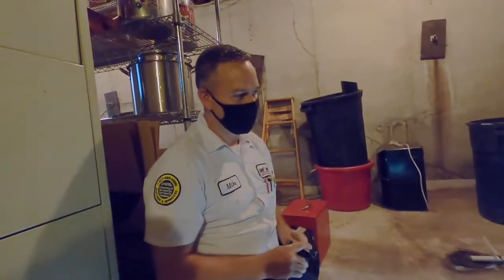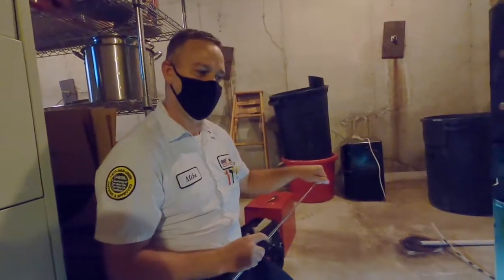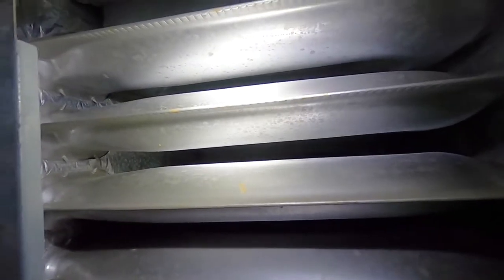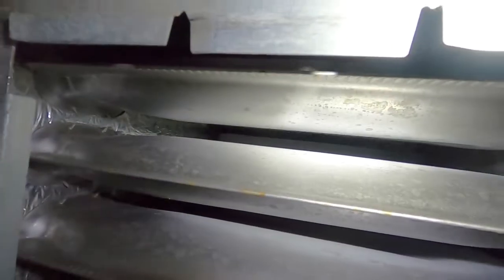I'm going to climb into this thing, use my flashlight and mirror, and go side to side just to make sure there aren't any cracks or flaws and that this is safe for the homeowner. Inside is what you call the heat exchanger. This one is made up of five separate cells — most heat exchangers have one block of cells all connected, but this furnace is unique. These five separate cells keep carbon monoxide and carbon dioxide out of the air you breathe and slow down the heat so it's utilized and pushed throughout the home. They kind of curve around inside there.